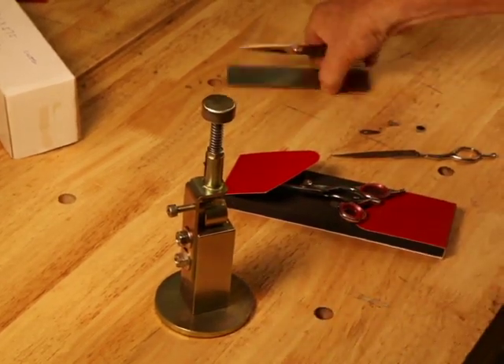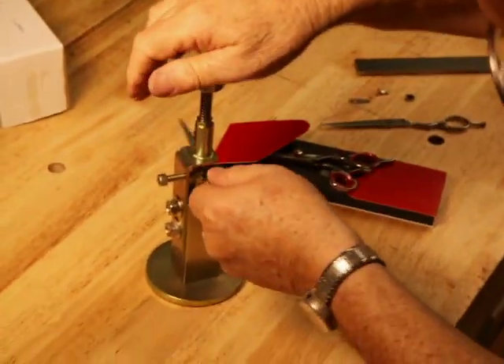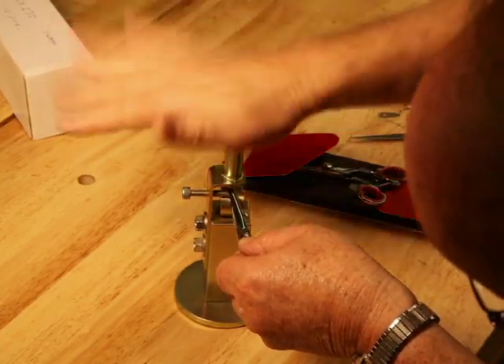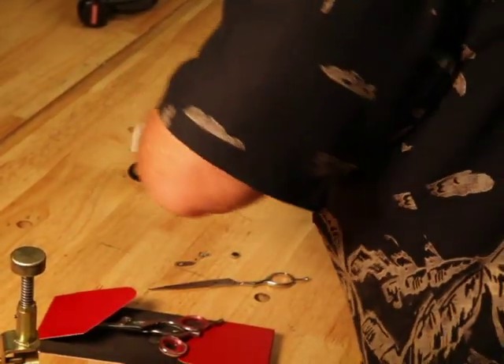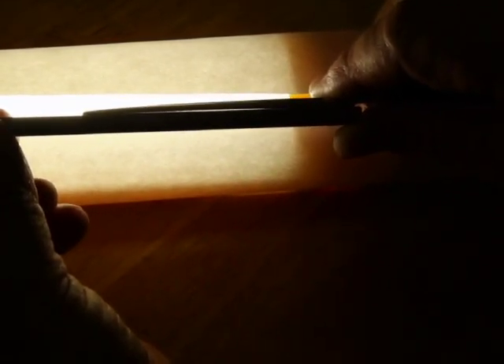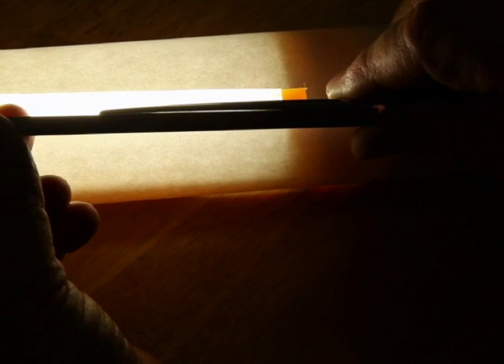I'm going to check this blade now to see — let me do a little more. And we have a perfect set. After using the pressure regulator, we have restored this blade to its proper function by creating an arch — a perfect space from pivot hole to tip. This blade is now set perfectly and will function correctly.